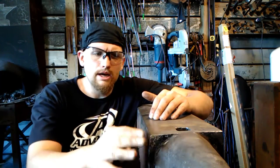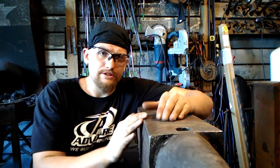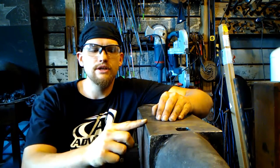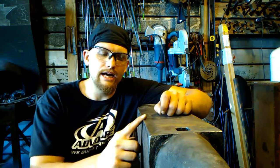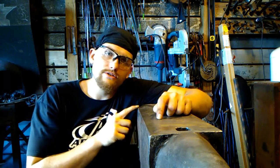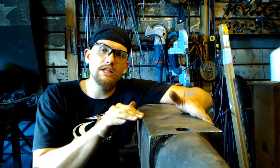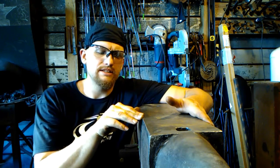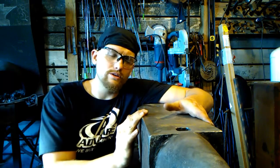My thought and opinion on anvil edges is as simple as this: there's nothing more than about an eighth inch radius on any of my anvil edges. Up here there's just a slight bit more, but I never work up there anyway. I always work out into the center, but I never put any more than an eighth inch radius on any of my anvil edges and I don't try to dress them. This one was already dressed with an eighth inch radius and that's the way it's going to stay unless I ever have problems with old chips or dings that I've got to work out of the anvil.